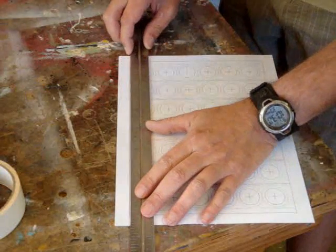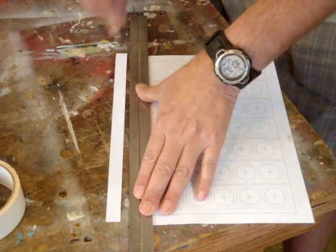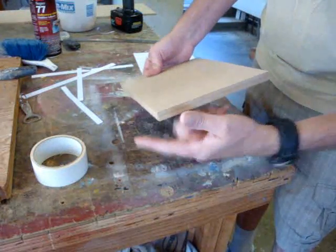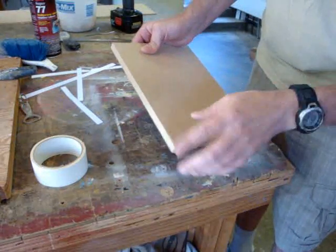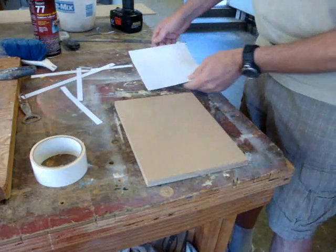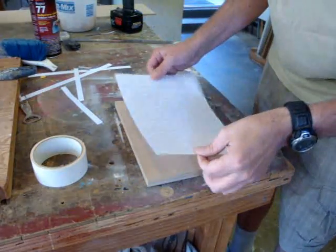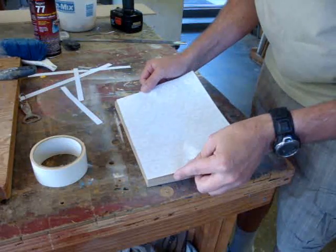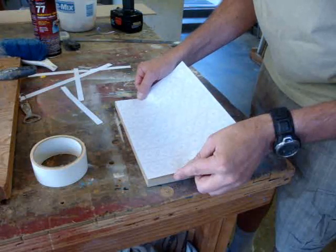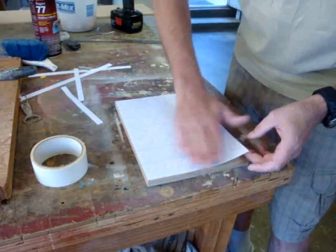If you want to use this template, go ahead and download it — you'll find a PDF in the description box or within the blog entry. I've got my two pieces of quarter-inch MDF cut down to 10 inches by 7 and a quarter inches and they're exactly the same size because they are taped together. I've applied some spray adhesive to the back of my template and now I can line it up. A tip when using spray adhesive: spray it on the paper and let it sit and dry for a minute before you put it on, and then it'll be easier to take off — it's almost like a post-it note.